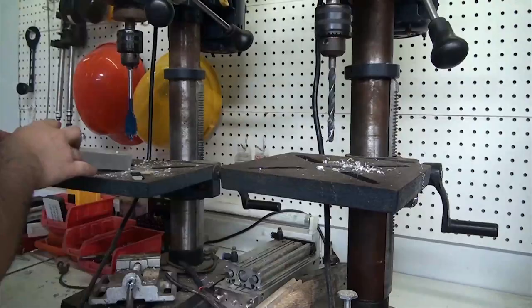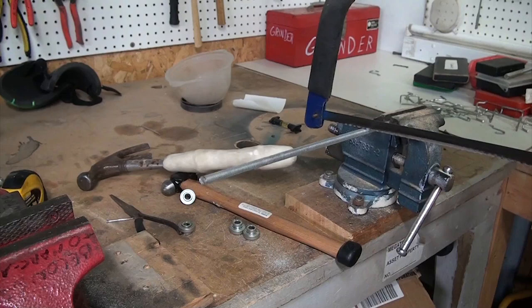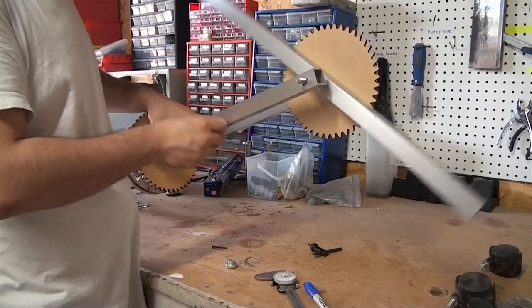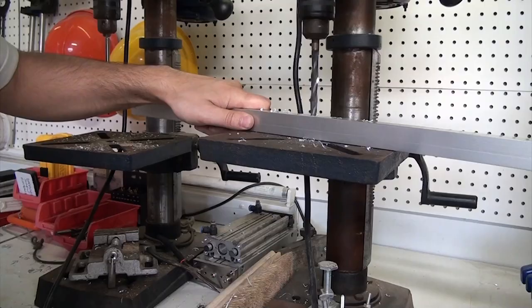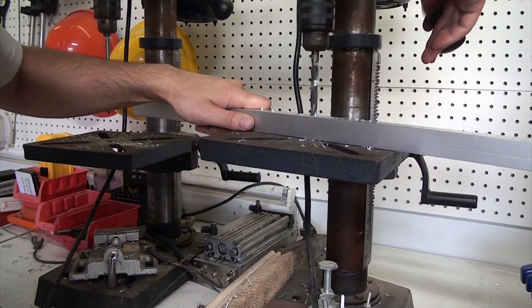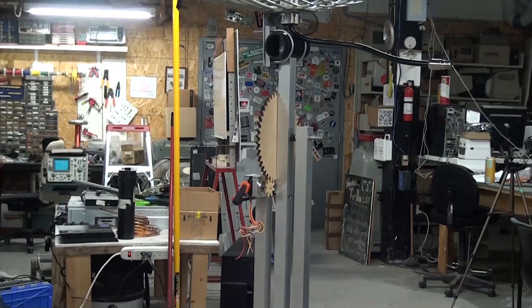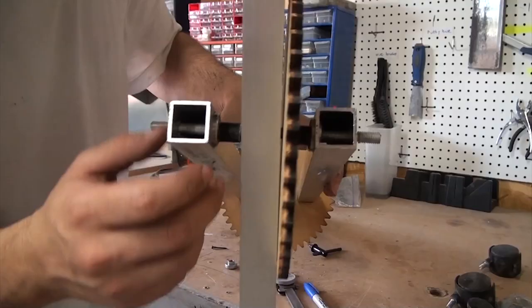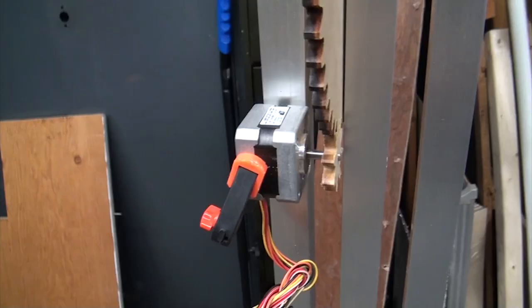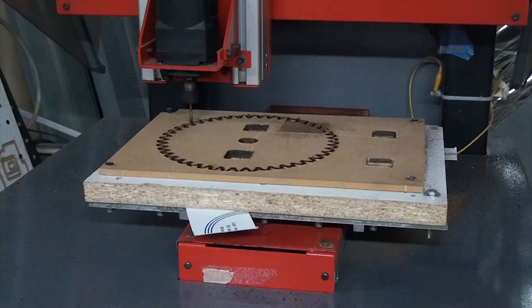Next, I drilled out holes for bearings at the top of the vertical supports and a hole in the armature to fit the upper axle. A piece of threaded rod is going to be used for this so that I can bolt things together tightly when it's time to assemble everything. I initially drilled a hole in the center of the armature bar, but later decided to drill one much further to one side so that I could use the armature like a lever, so it'll require less weight to counterbalance things. Once the top gear was cut, I test fit everything, then cut two small pieces of steel tubing to act as spacers that'll keep everything centered.